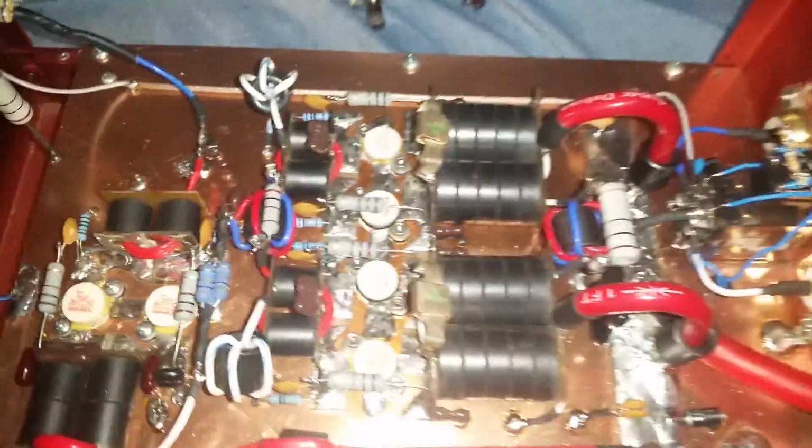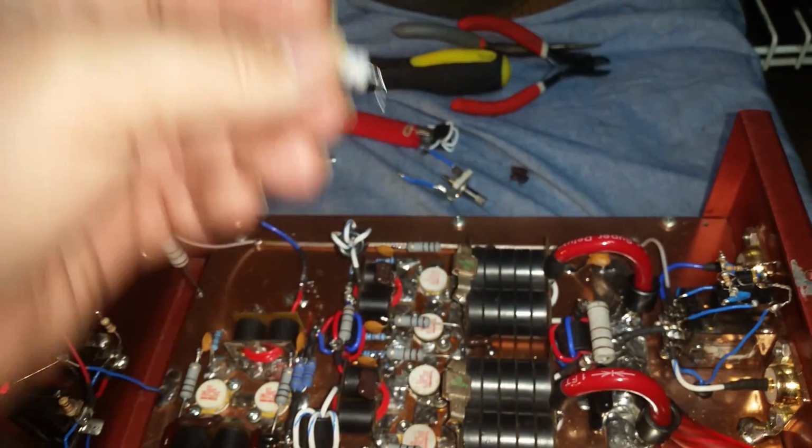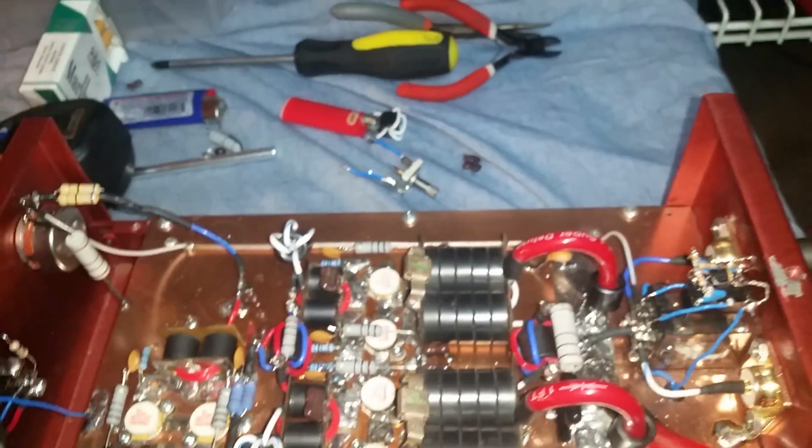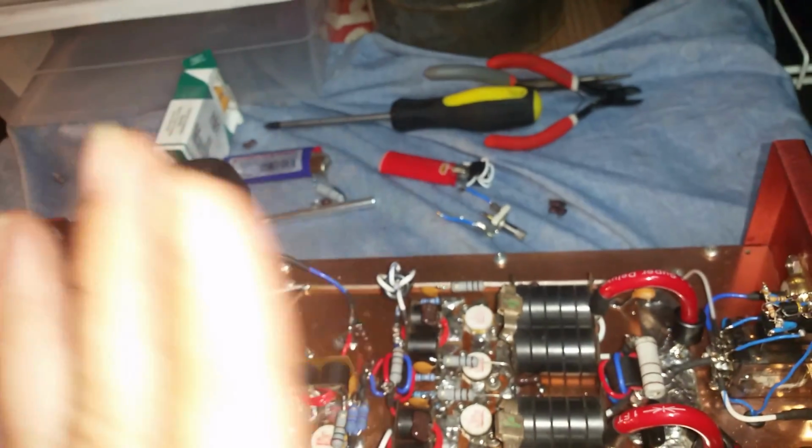But so anyway, this is what we got now, bud. I got it on the medium tap right now, and I have no problem getting the KW out of it just with the bench radio. So anyway, we got the variable all the way up. Let me explain before I did any of this. After I took this 68 input pad out, with the bench radio with a 1 watt dead key, I was getting about a 280 watt dead key on the bird here. 280.